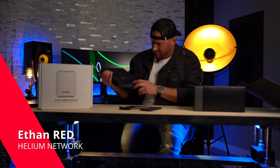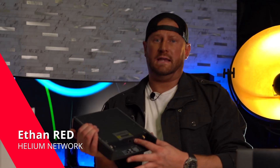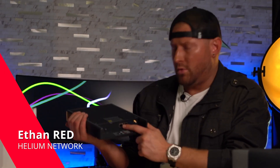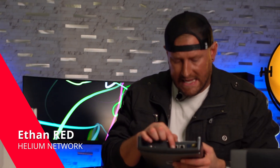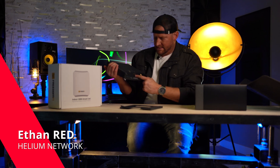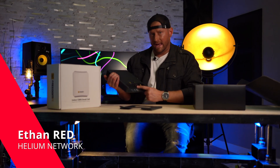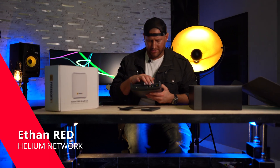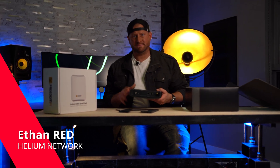You're going to plug the LoRa antenna into your WAN. The other line is going to be going into your internet, your ethernet. The only other cord you'll be plugging in is the ENB, which will actually go into your FreedomFi CBRS small cell antenna. It will go from the antenna into the ENB only. Your WAN goes directly from the ethernet cord, your router, into the WAN. Don't worry about the USB for right now.